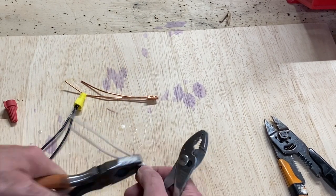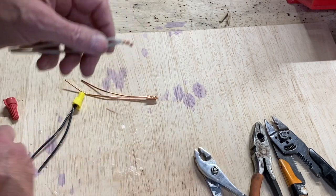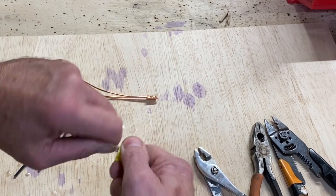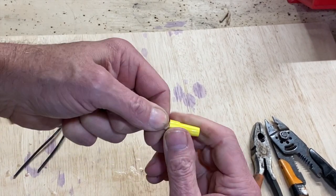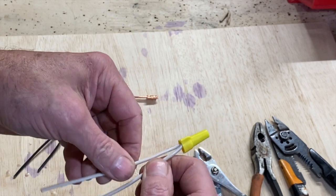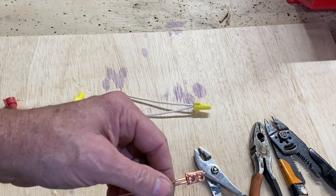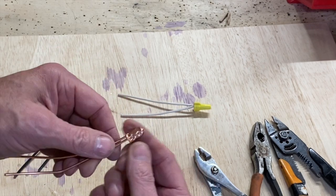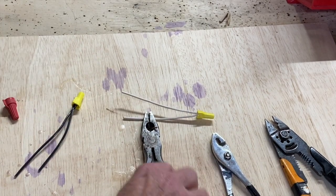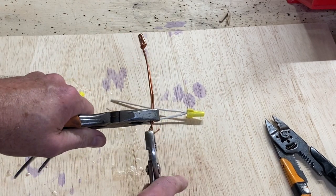Give it a good twist, trim it off. You want to trim it back to approximately a half inch of exposed conductor, then apply the wire nut and twist it on tightly. That gives you a good joint — pre-twisted with the wire nut applying appropriate pressure as an approved bonding mechanism. For bare copper, you can use a wire nut or a copper sleeve as I've done here. Pre-twist before applying the sleeve for bare copper junctions in the box.